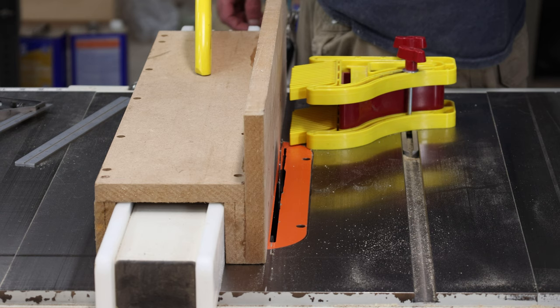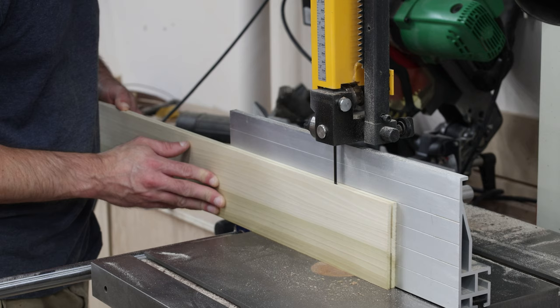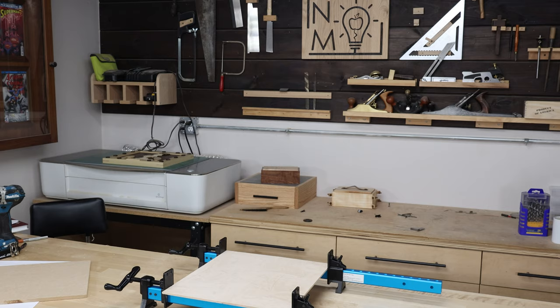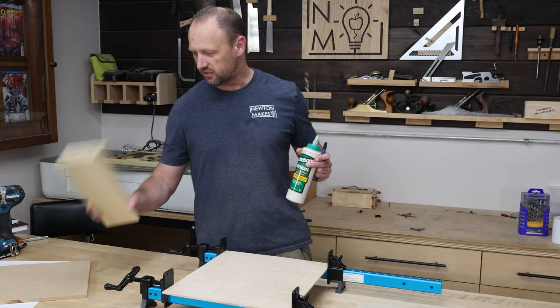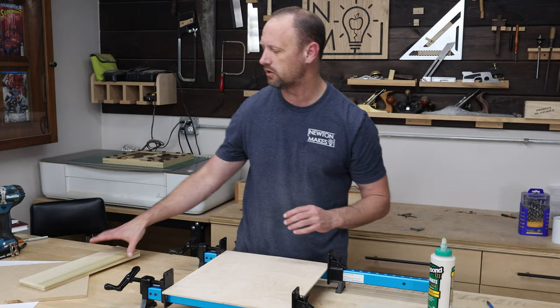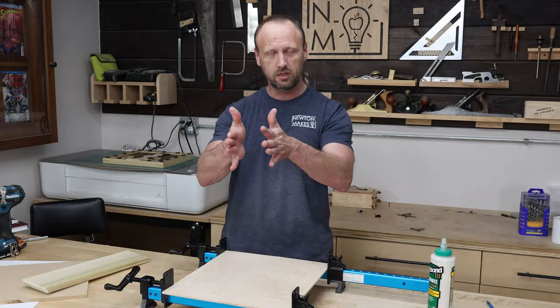I need two ultra thin wood panels. I need a background for the artwork and also a kind of crappy looking panel that's going to go on the back side of the project that you're never going to see. I like to keep my pieces a little bit thicker for glue up and then make them thinner after the glue dries. Both these panels are going to get glued onto a piece of MDF. I've got some thin pieces of poplar, some maple and glue. I'm going to glue this beautiful maple together and the poplar too, so I have two super thin panels that will get sandwiched onto my MDF.